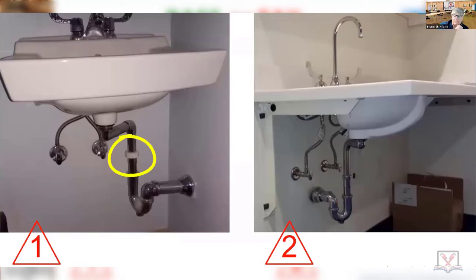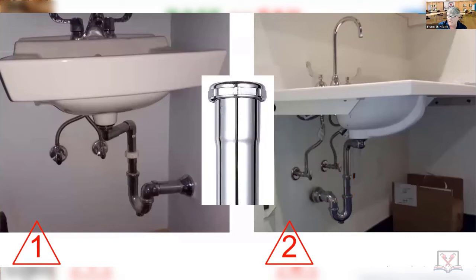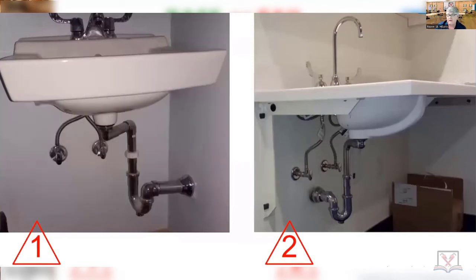As Ethan said, the other is PVC — so we've got PVC on a piece of brass. That is a particular schedule of brass. Anybody know the schedule of the straight waste and the trap? Anthony: 17 gauge. That is awesome. When you pick up 17 gauge tubular brass, straight waste, or anything you're looking at here, you'll know the difference. Home stores won't be selling you 17 gauge schedule brass off the shelf — your plumbing supply houses and wholesalers will, because they know the code requirements. That's actually a question on the exam.